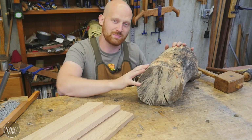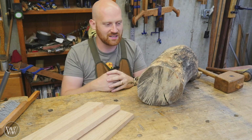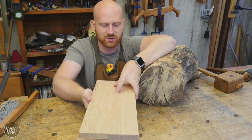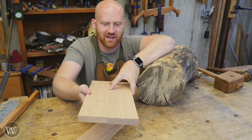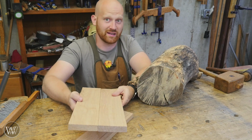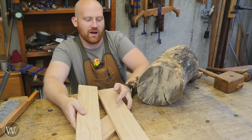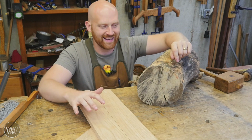And if you think about it in terms of expansion and contraction as opposed to just general wood movement, you start to see what is going to cause a problem. So if you're in a house with a lot of air conditioning, you may find that your wood really doesn't move that much because you have a fairly regular moisture content in your house, so it's not going to move that much from season to season. But if you do have a large moisture movement, particularly if you're in a moist environment that has several seasons, you'll find that that wood will expand and contract a lot. Especially if you do anything with outdoor furniture, you will see a wide movement of expansion and contraction. So you've got to plan that into it.